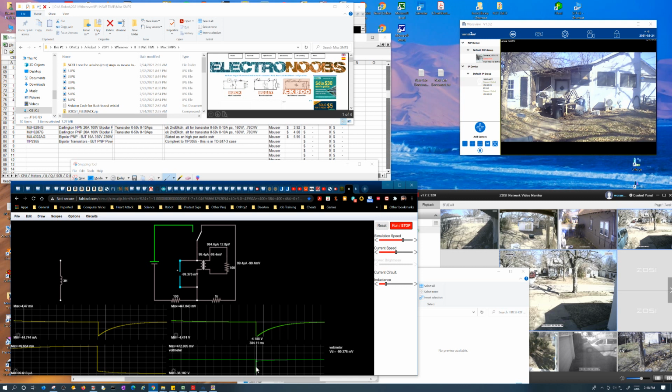It's still acting like a big negative voltage spike, but then it very quickly drops to 5 volts. So you see a very quick initial spike, and that's probably the transient period, while it's trying to figure out, hey, I got a resistor here, should I behave like an inductor, or should I behave like a transformer resistor? Because remember, this is a 1-to-1 ratio transformer I got here, so it should be reflecting this 1-to-1. That's why I suspect that this and this are playing off of each other during the charge curve. That's why this defaults to 25 milliamps instead of 50.